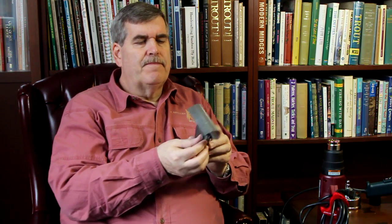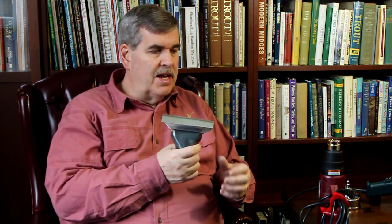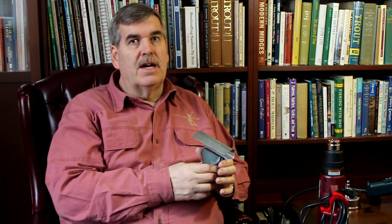So I've taken my original way and improved it a little bit. These heat guns are about thirty or forty dollars — pretty inexpensive. I just took a piece of sheet metal and put a couple pop rivets in there. You could do a nut and bolt, or drill some holes to adjust the airflow. I went from about a minute per node down to about 20 seconds when this thing was hot and cranking — that's a significant saving when you're doing 36 strips times two or three nodes, so seventy to possibly a hundred nodes.